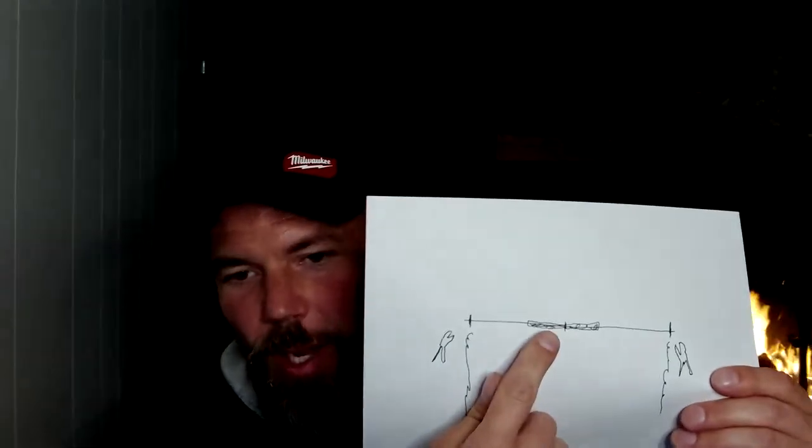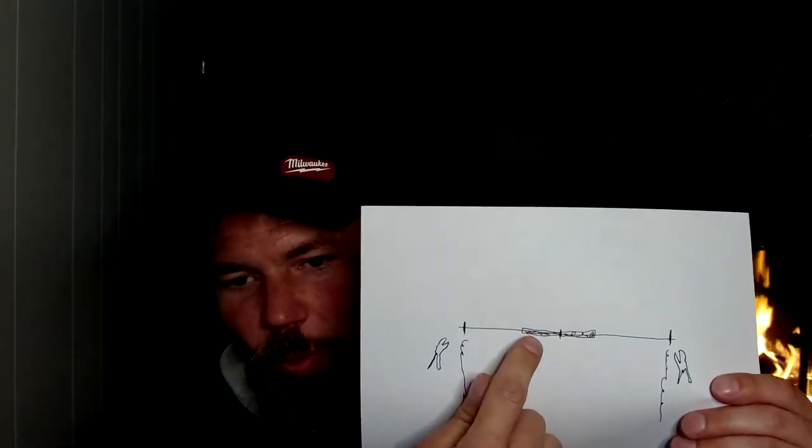Like I said, it's not that you can't do it with the winding bars and whatnot. You just got to be really, really careful, because if that spring slips or if the set screw's not down deep enough, you really should technically unwind one spring and then do the other. But I've cheated over the years. I back mine one spring right here. Doesn't matter what side, but really you should unwind both to be safe, or at least dump it. It's just difficult because if you dump one side, you got to remember when you're trying to pick up the other side, the door is lifting, and it's a little bit more complicated.